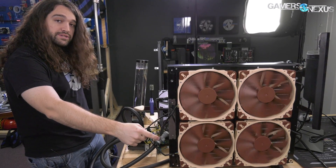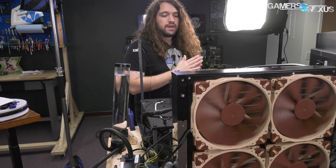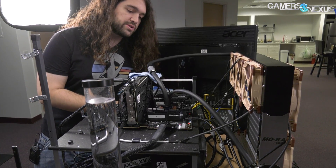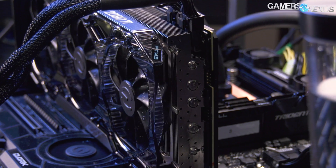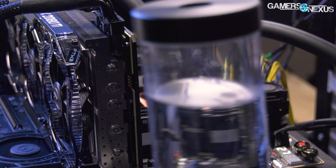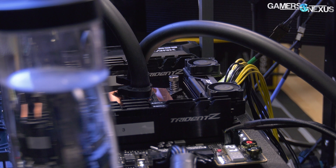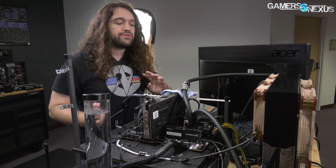We have some QDCs — quick disconnects — connected, which will make it easier to extend tubing length if we dunk it in ice later. For the motherboard, we have an EVGA X299 Dark, which we've been using for 100% of our X299 overclocking livestreams because it's one of the easiest boards to work with at this level. Not great for stock usage, but very good for overclocking. On it is a kit of G.Skill Trident Z black memory at 3600MHz — we've used this memory since RIP-LTT with the Titan V. It for sure does 4,000MHz, but we couldn't get it there last night.